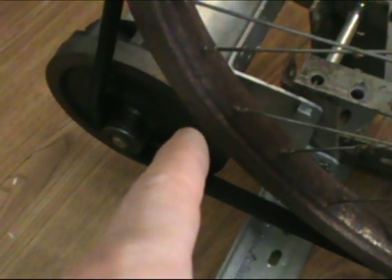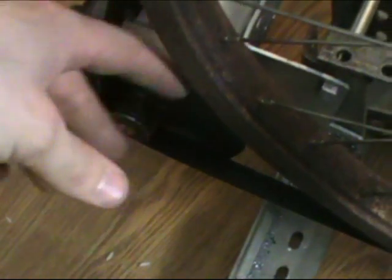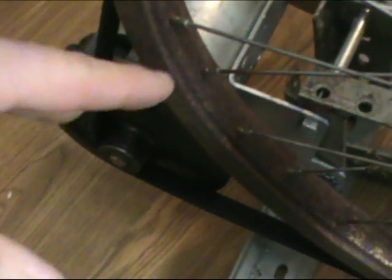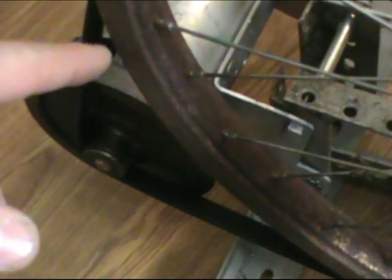Okay, now right before I go to wiring the motor, I want to make sure that everything's adjusted into place, and I put on the belt that I've acquired. I had to measure it out. Since this is a custom build, you'll have to measure your belt length. A quick way to do this, once you've got your motor in line with your wheel centered, is to take a piece of string, run it all the way around, and mark it. Either that or use the measuring tape a seamstress uses to measure people and then sew the clothing.